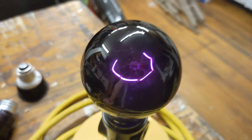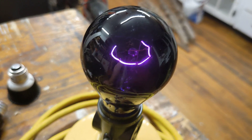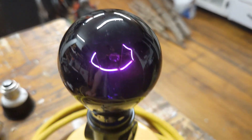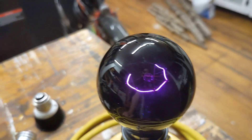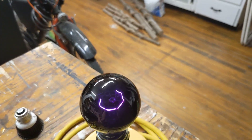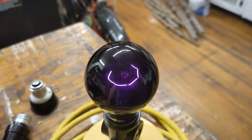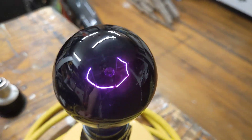The filament is operating at several thousand degrees Celsius. The hotter it gets, the shorter the average wavelength of light that comes off of it. A classic 60-watt or 100-watt incandescent light bulb operates at about 2,700 degrees Kelvin — that's around 2,500 degrees Celsius, maybe 4,000 to 5,000 degrees Fahrenheit. But that filament, as hot as it is, is only half of the temperature of the surface of the sun. That's why incandescent light bulbs look yellow compared to sunlight — the wavelength is shifted towards the red side of the spectrum because the filament is not nearly as hot as the sun.